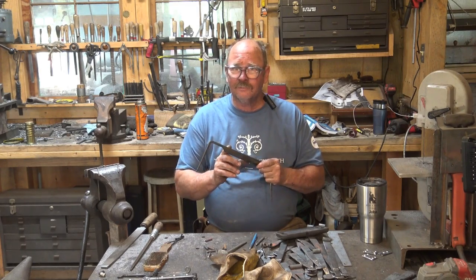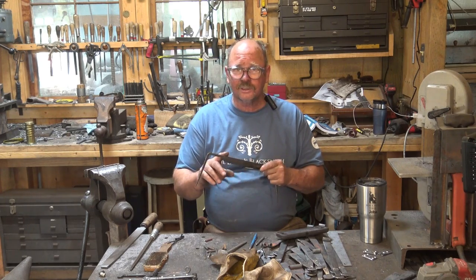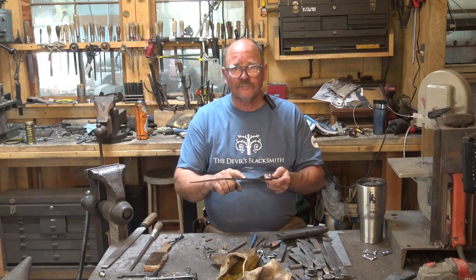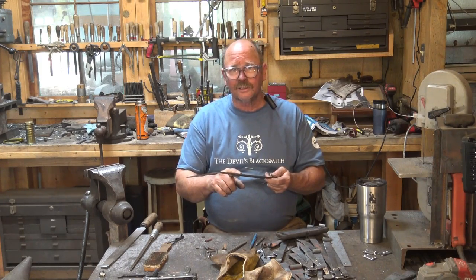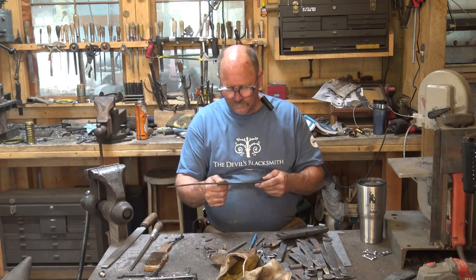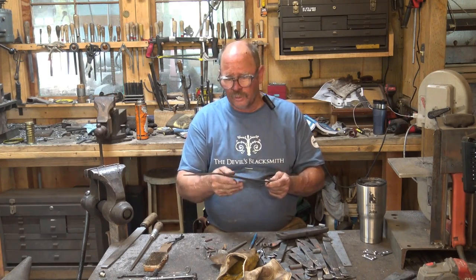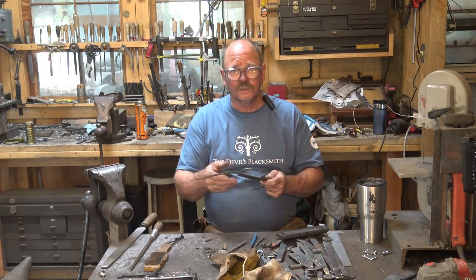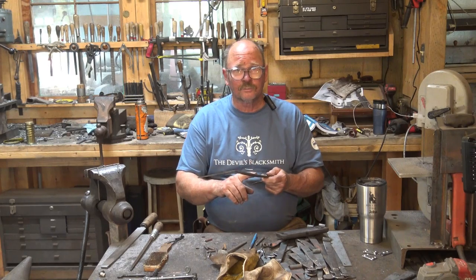But if you have any little high or hard spots, any place where you didn't temper it back, like right here we have a little bit that isn't tempered perfectly, that's a little bit more likely to crack. So to do this, I would figure out that we came into what's called peacock. We didn't really quite make purple. Purple is just a little bit hotter. So let's take a look at a chart and see what color peacock is.